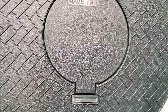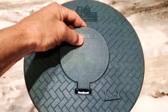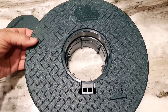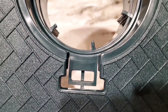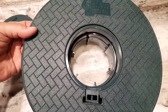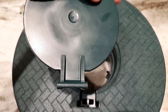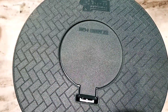I want to talk about our stage 3 technology built into our FDM pop-up. Most people don't realize that there's three stages to this pop-up. Stage 1: the water runs underneath the lid to some holes that are at the hinge point, allowing the water to run underneath the turf restrictor plate and act as a soak-away. You can see the cutaways on the underneath side of the lid. This is stage 1 — a light rain, a mist.